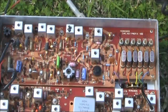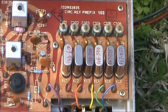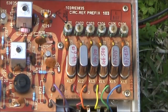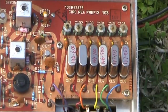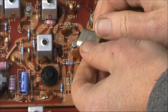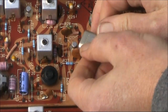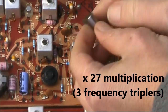The board at the back is for the transmitter. Again, there's a bank of six crystals with trimmer capacitors to get them on frequency. They need to be within a few kilohertz, otherwise your signal will sound raspy and in extreme cases unreadable. Looking at these crystals, which are made by the Australian manufacturer Hi-Q, these are around 5 megahertz, which means that they have to be multiplied up quite a long way.